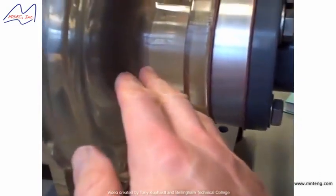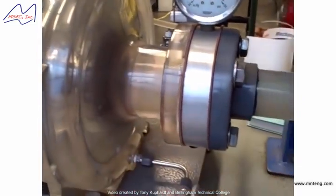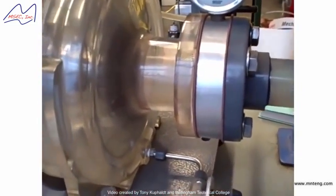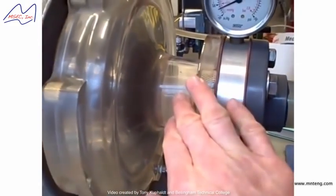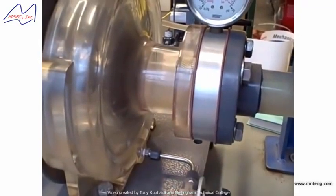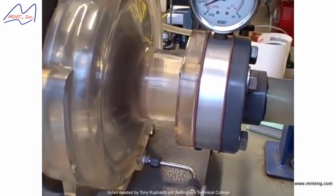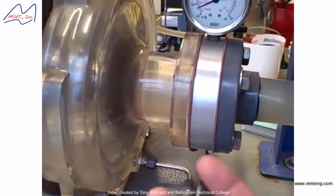We can see it happening here. We can also see some bubbles here at the scroll casing of the pump. Cavitation is very destructive, especially upon metal surfaces. The acrylic surfaces here seem to handle it a little bit better, but with metal surfaces it'll give — that's very destructive. The metal becomes pitted by the high-pressure jets formed by the collapsing bubbles.